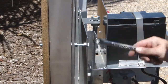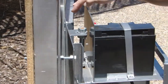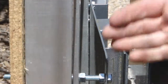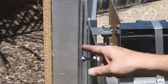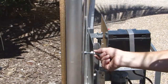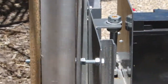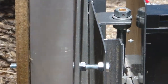You can see now we've got all four bolts mounted to the gate, and it's an angle mount. The inside is mounted directly to the gate post, and the outside is mounted about an inch, an inch and an eighth, right around in that ballpark on an angle. We've used three-eighths bolts and three-eighths nuts to provide the mounting for the Gator Power Gate.